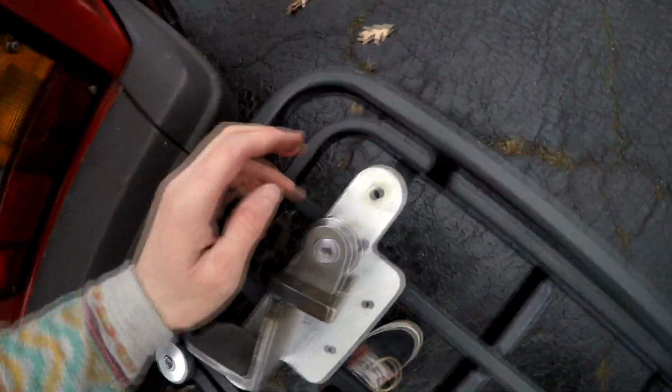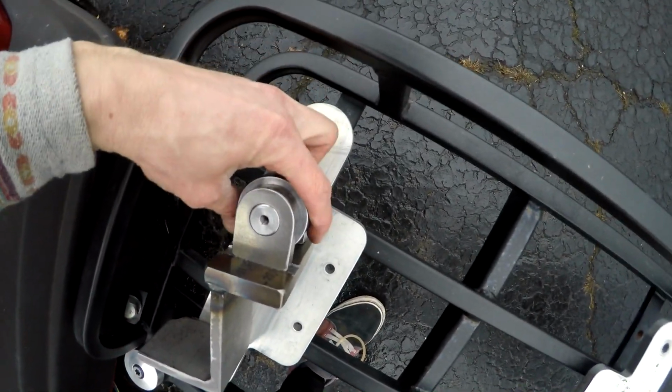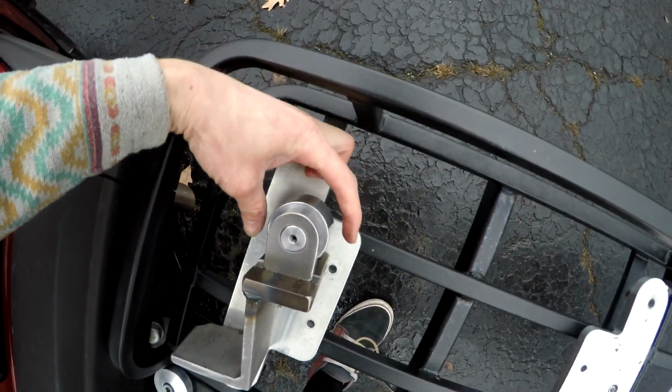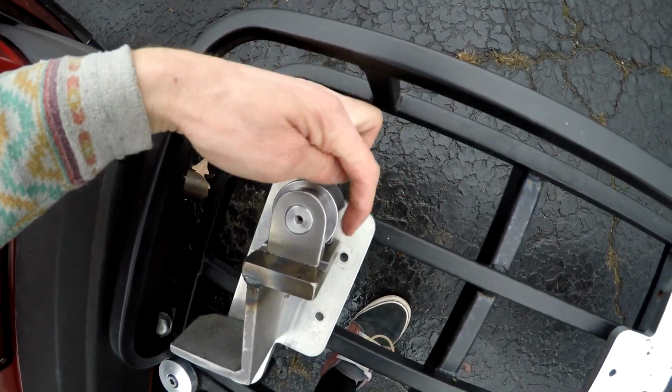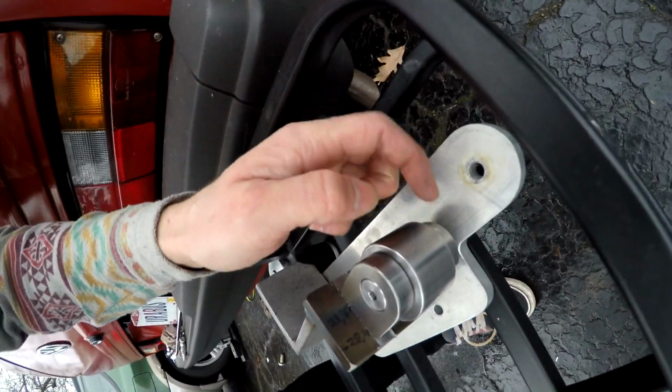This 1x2, and this, where's it at? This, well, is 2-inch, so the piece of material I'm going to cut to where it will fit like so, and it'll come to each peak, and I'll be able to weld across here, and it's about 25 millimeters wide. This is like 32, so it'll be like 3.5 mil on each side, enough room for the weld to go, so it's not right on the edge.